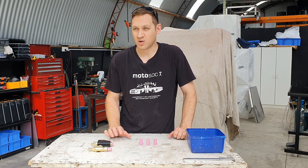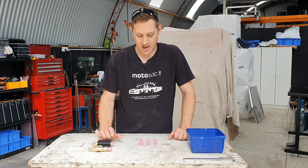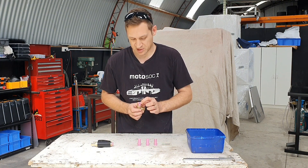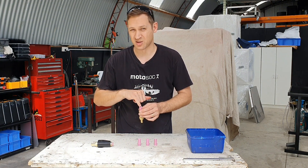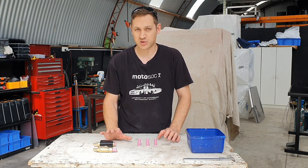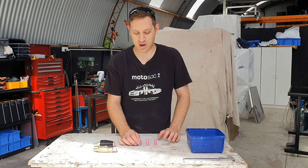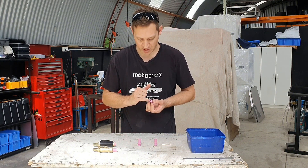It's not a massive difference, but when you're trying to get a little bit more performance out of these, it was actually significant enough to bother going through and supplying them with 8mm tips. I don't actually buy them — I pour them out. It's a pretty simple process. Quite often you'll find that they are not drilled very concentrically — the way they're cast means the hole in the middle is not exactly concentric. So I'll usually do them in batches on the lathe, and doing them slowly will usually clean it up quite nicely. A lathe isn't exactly crucial if you find a relatively concentric one.